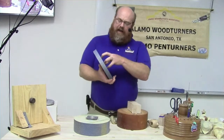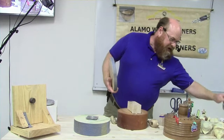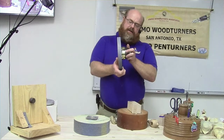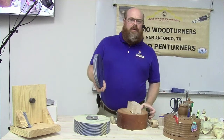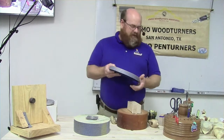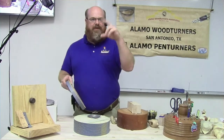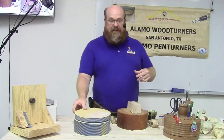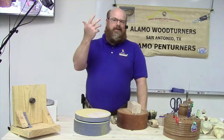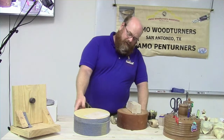The chuck that I use has a step jaw on it like this, and I use that as the outside gap. When I have it fully closed in there, it's the perfect size to fit corner to corner on this guy. I have about a half inch of play, so that's how I chuck it on the bottom, and it works well. I recess it maybe an eighth of an inch, so that it's not that high up off of each of them.